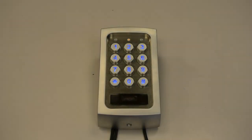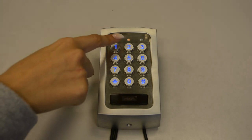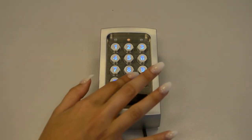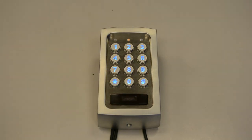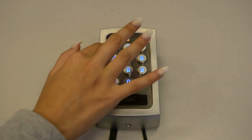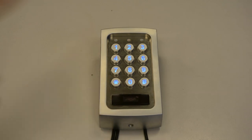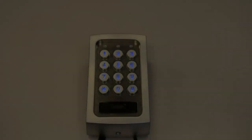To add a pin only to relay 1, enter 10 and then enter 2, which is the location of programming a pin only. I will then enter 001 — this sets the first pin's location. You can go up to 999 pins but we will start at 001. Then enter your four digit code, which I will enter as 1234, and then press hash to confirm and star star to finish programming mode.